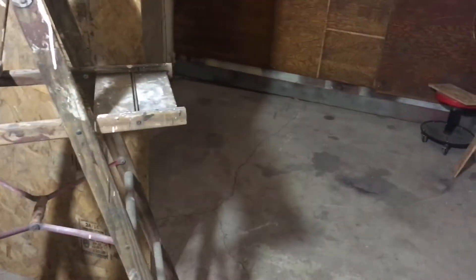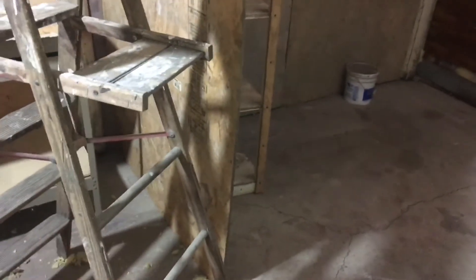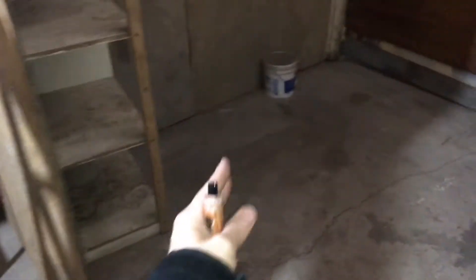I'm going to put a door over here on the right side. I'll probably have a fan over here somewhere — I'm going to do a positive pressure booth, so it's going to force positive air pressure into the booth. My heater will be over here pushing hot air in, and over here on the wall we're just going to put in a vent exhaust right out the wall.